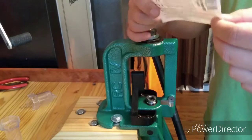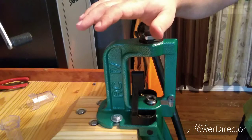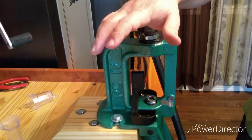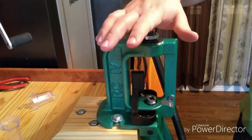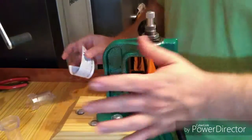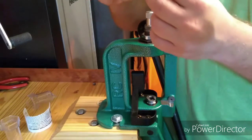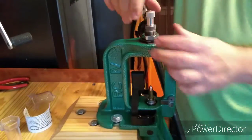Number 4 explains the carbide. The case is sized as it enters the die and again as it is pulled out of the die. This assures you every case will freely chamber in any standard gun. Don't expect the carbide sizer to touch every case. It is a fail-safe tool for the occasional bad round that could ruin your day. So I like that feature about this die. If you have accidentally bulged your case a little bit loading your round, it's going to push it back down and you're going to be good. These things came out really great out of the sizing die.